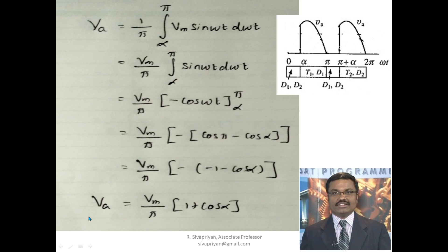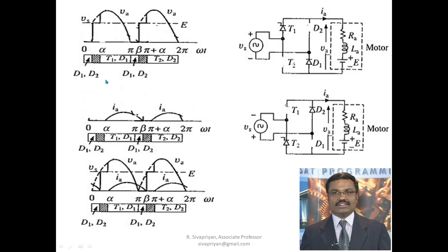This formula is for continuous current conduction. Now we discuss discontinuous current conduction. In discontinuous mode, the armature current remains zero for some time — from beta to pi+alpha. During the positive half cycle, current flows from Vs+, T1, armature, D1, to Vs−. During the negative half cycle, the inductor switches polarity and D1, D2 become forward biased, causing freewheeling.